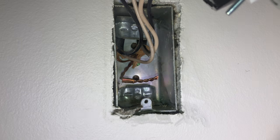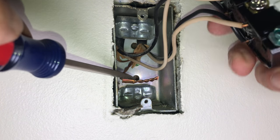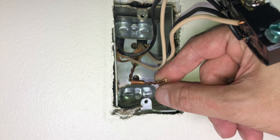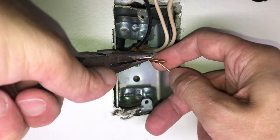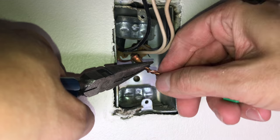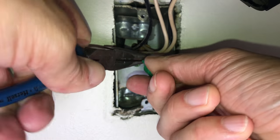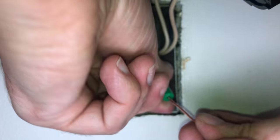Since the original outlet was not directly connected to a ground wire, I now have to add one. The ground wire is the one without any insulation — the bare copper wire. I'm going to use a pigtail that I connect to it so I have something to go to the outlet. I'm wrapping this pigtail around the existing connection, going right into the little thread. Then I have this special green grounding nut that I'm going to put on here and tighten so it will never come loose. The opposite end I'll connect to the outlet.